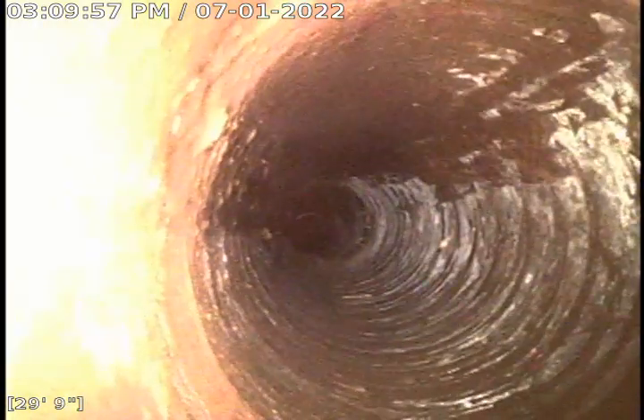Nothing really remarkable here. This really is just good-looking clay pipe — it's not holding water, so we've got good grade. You can see where roots were that we've cut flush with the pipe. We left tiny little hairs in the 6-inch because our access given is 3 inches. For the most part we've got them all cut flush.